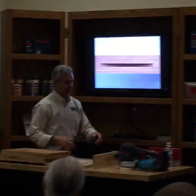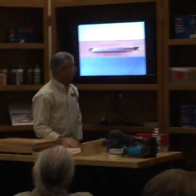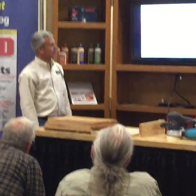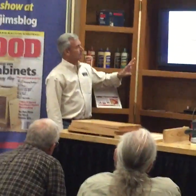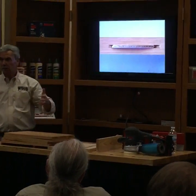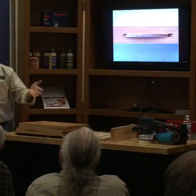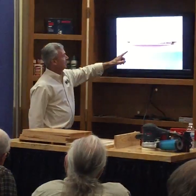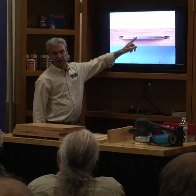But the problem I found, we were just in Houston a little while ago, in Atlanta, which makes it easier to understand, is that these little biscuits are pressed beechwood, under hydraulic pressure with no humidity. Sometimes just lying on your workbench makes them start to spread just a bit. So you may find that these biscuits don't go in that perfect slot.